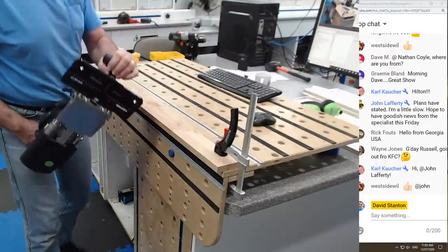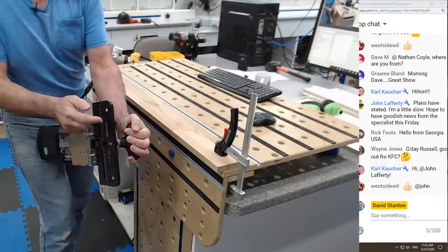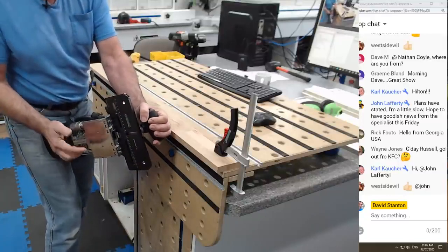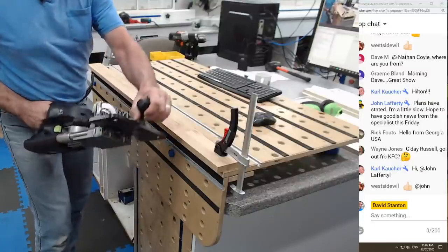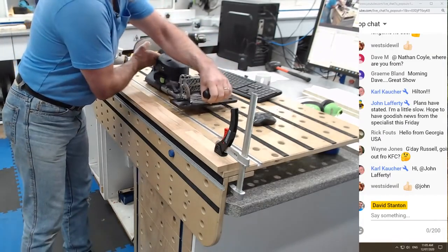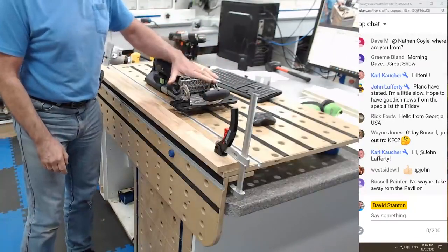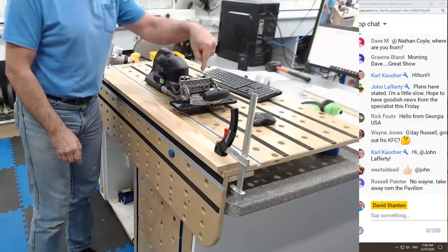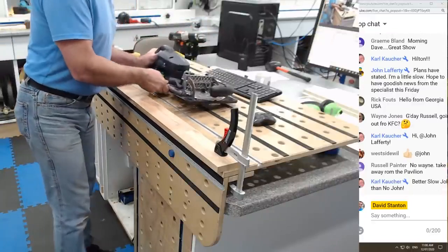Now I've already got the Seneca dock plate, which is 10 millimeters thick, which allows me to use with the RTS 500 that I've also put in here from Seneca. It allows me to do small work with this bigger machine. Something to think about. It's 10 mil thick, so instead of reading off the side at 10 millimeters, it will be zero. So 20 millimeters will be 10 from the bottom of the plate to the center of the cutter. Just a little thing.